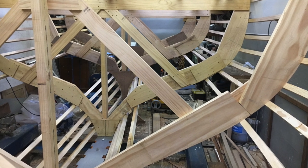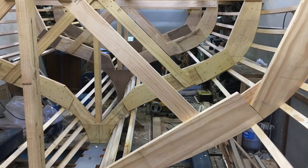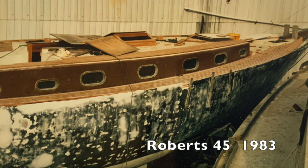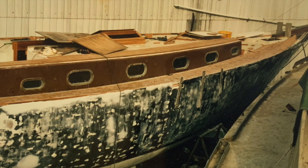The first thing is to make sure that when you set the hull up, you've set it up fair — set the moulds up so that the planking will follow a fair curve. If you don't do that, you're in trouble from the first. About 40 years ago, a friend and I were engaged to fair a 45 foot fibreglass hull that was amateur built. It had been built in a shed close up to one side, and when we checked with battens, one side was reasonably okay, but the other side that had been against a wall was up to about an inch and a half, 40 mil or so out. There's no way we could have put enough bog on that to fair it, so we did the best we could, but the boat was always awful. You've got to get that part right in the first instance.